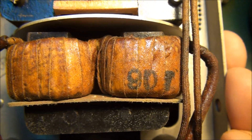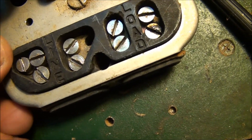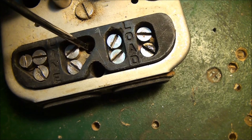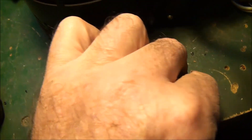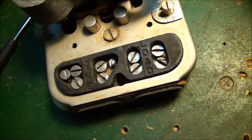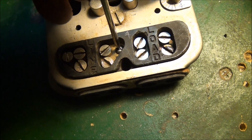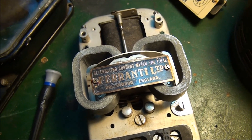These coils are probably extremely well made and they've probably been given lots of waterproof coatings when they were assembled, so they should survive. It was missing a BA style thread screw in here - that's what connects the voltage coil to the line voltage. So the screw that goes in here to connect it to the line voltage block was missing, so I had to have a bit of a scrounge in the junk pile and I found another screw which I've cut down to size, and hopefully that will do the job. Anyway, I'll reassemble the meter, put a load on it, and see how it works.